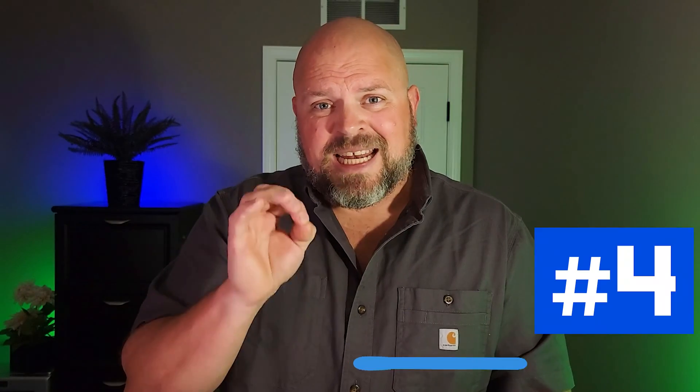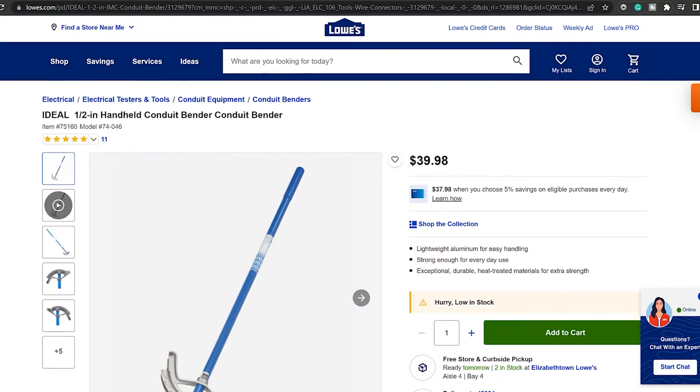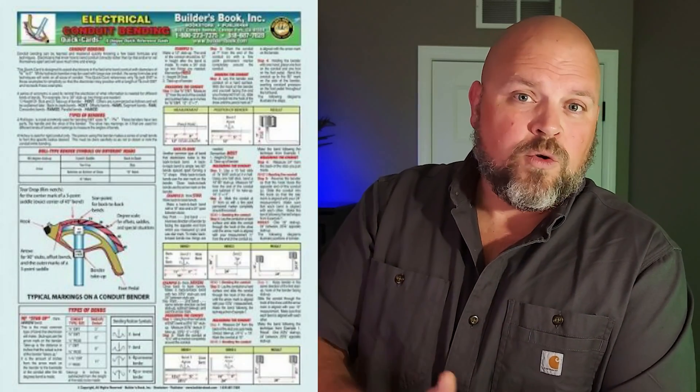Number four: because the DC current is being converted at the panel, I did not have to use EMT conduit. As a DIYer, I didn't have the tools to make the bends that may be required on a custom solar installation. I do have experience working with Schedule 40 and Schedule 80 PVC pipe, so there was really no learning curve there. But if I went with DC and had to run EMT, there would have been a much larger learning curve. So in other words, it made my installation process a lot simpler.